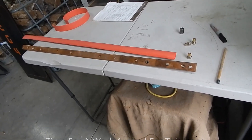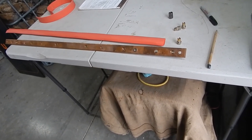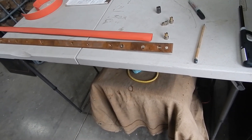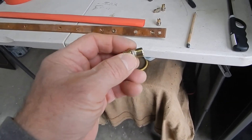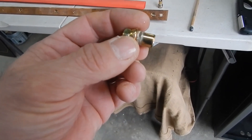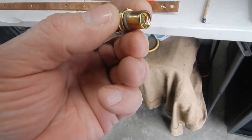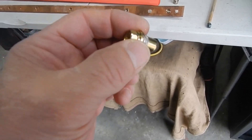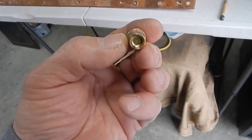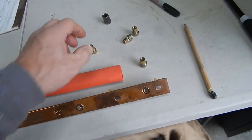It's time for me to step away from this project and do a little investigating. As of this moment, this setup as it arrives from the factory — I have absolutely zero faith in it whatsoever. These rivet nuts ripped right out; they're just pressed into copper. I may try to braze them down or attempt to solder them in place, but I'll probably just use a nut and a bolt. If you get one of these bus bars, check them out carefully, because bad things are going to happen. I just can't believe they're selling this stuff.